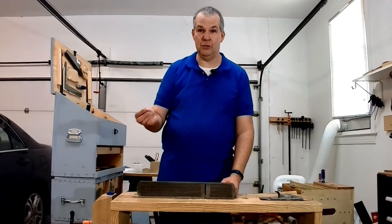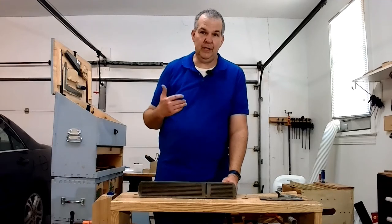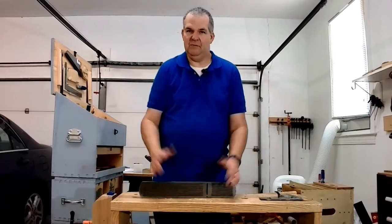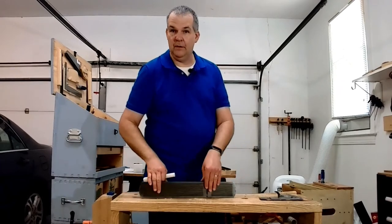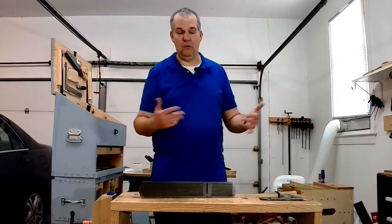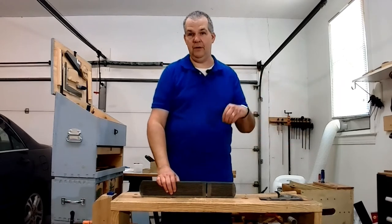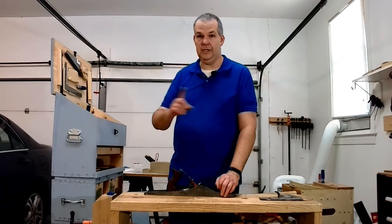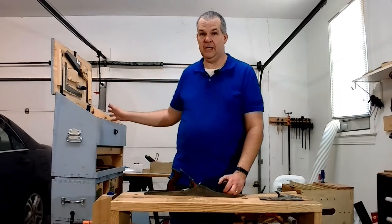Modern planes are, for the most part, all metal, and there's not this corrugated business anymore. For me, I don't mind the corrugated. A lot of you probably know that putting a little bit of candle wax on the bottom of the plane helps it glide a little faster — it's more for having a smoother cut than for speed. I use candle wax, especially out here in the garage where there's humidity. This plane stays in the bottom of the Dutch chest, and the other one lives in the top of the Dutch chest, which is put away when weather is inclement.